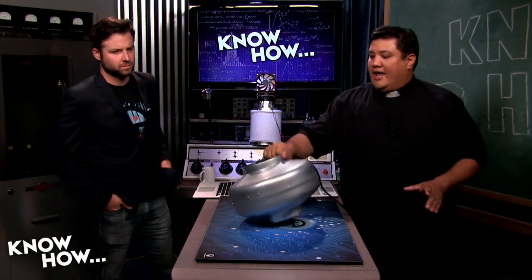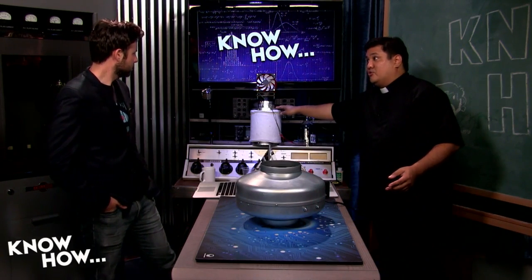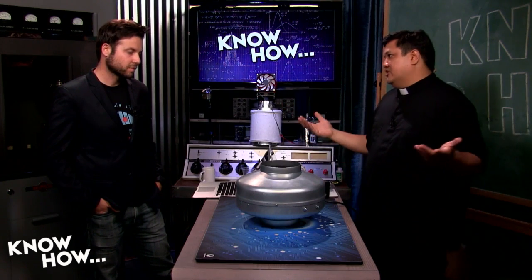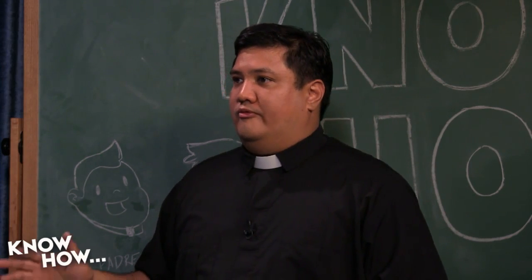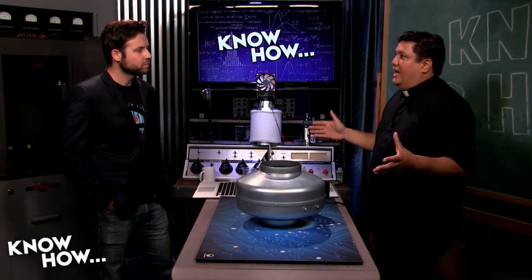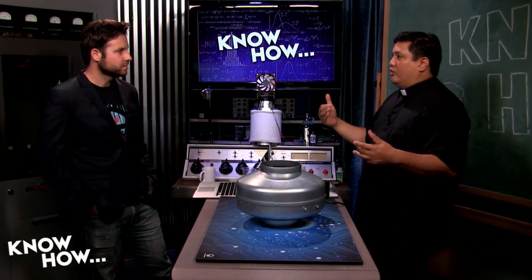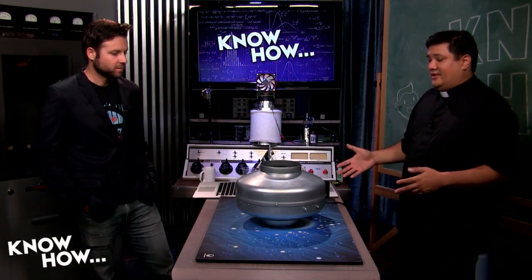You see, every time you add ducting, every time you add something that's going to restrict the airflow, you're going to reduce the amount of effective airflow you get. You're just adding resistance. And that's not good. I typically tack on 25% to give me overhead. So if I've got a 106 cubic foot, or let's call it a 100 cubic foot tent, I say I need at least a 125 cubic foot per minute setup, in order to actually get what I think I'm going to get. Okay, that makes sense.